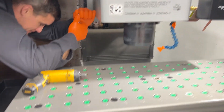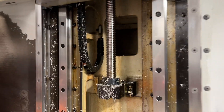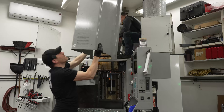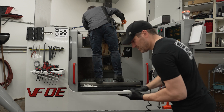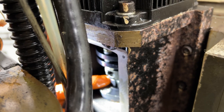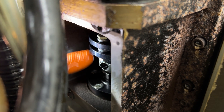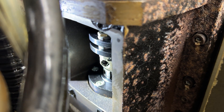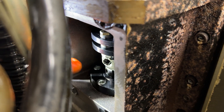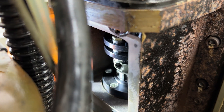You said the Z is the worst? It's the most difficult because it's suspended. The ball screw looks good. Cover's off, making progress. Gotta clean the panels — they're nice and shiny. This jam nut pretty much holds everything together. Once you loosen this bolt, this whole thing pretty much spins off like a nut. This is the coupler here. These two things you just loosen and then the motor will just pull out.